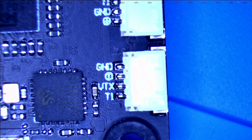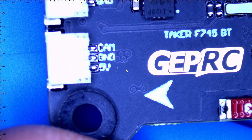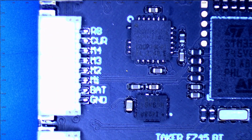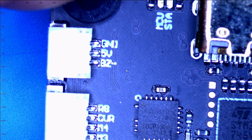There's your arrow letting you know the front-facing direction for the flight controller - that's where you want to point it when you mount it on your stack. You can also go into Betaflight and rotate that with your gyro alignment, so don't get hung up on it. Right here you've got cam, ground, and 5V - that's where your camera goes. Just above that is where your ESC connects. And above that you've got ground, 5 volt, and buzzer minus - so if you have a buzzer, that is where you'll connect it.